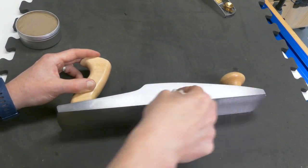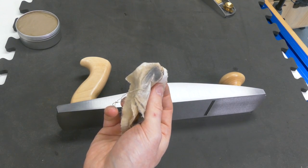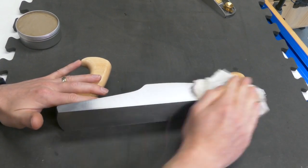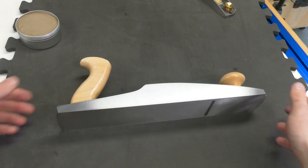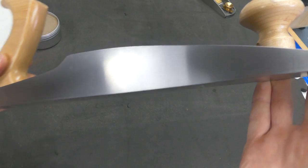This is not so much about making it shinier — although it will help the planes glide over your wood much more nicely. It's more about the protection. There are waxes and other natural oil components in Step One and Step Two which are going to stick to the surface of your metal and prohibit it from rusting quickly in the future.